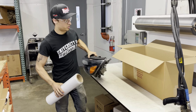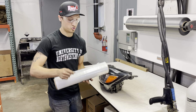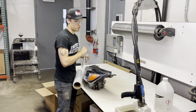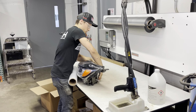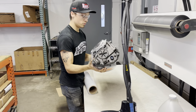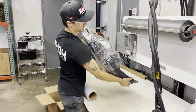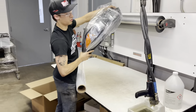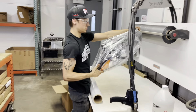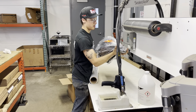You want to be extremely careful with this step. Do not use shrink wrap — this is stretch wrap. You can either have someone hold it while you wrap the headlamp, but you can usually get away with one person. I just start my first roll around it and then lightly go around it like this. I do this because if foam seeps out of this protective material and gets on the headlamp at all, it's ruined — you will not be able to get that foam off. This stretch wrap acts as a second protective barrier for the headlamp, and it has saved my butt before. There have been instances where the foam got outside the liner and landed on the headlight, but the stretch wrap protected it.